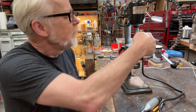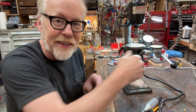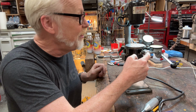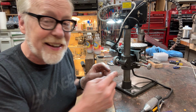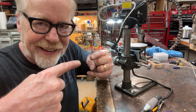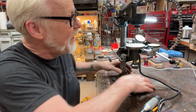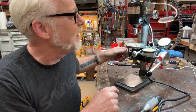So here, the lead screw comes out and the grub screw goes in, and once you have the dial set to the correct position, you put the grub screw in and you create this tension relationship using the grub screw. Here, there's actually a big gap of about 1 inch, and inside there is this brass rod, and the grub screw pushes against the brass rod, pushes against the lead screw, and holds it so that when you turn it, everything turns together. And I had some stiffness in the X feed, and I got it out today.